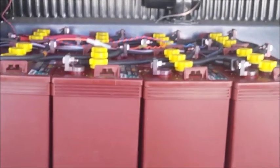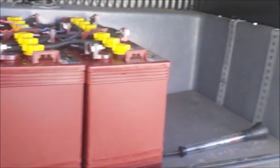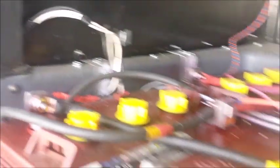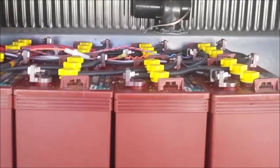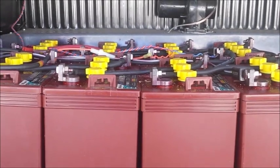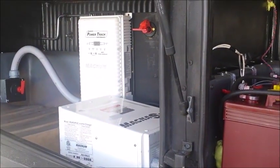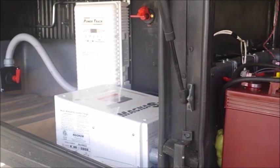You're probably asking how does an RV compartment hold this much weight? It's just a plastic compartment to the naked eye. But in actuality I have 18-gauge steel straps that run along the bottom all the way over and up to the other side. On top of those straps I have a three-quarter inch piece of plywood and foam playground mat material that helps absorb shock when going over bumps, keeps everything staying still, and insulates as well. You want to keep your batteries insulated — if they get below a certain temperature it's really hard for them to charge, and same thing with getting too high a temperature. Your Magnum controller will shut the power off going to them if they exceed a maximum temperature, using these battery bank monitoring jacks.